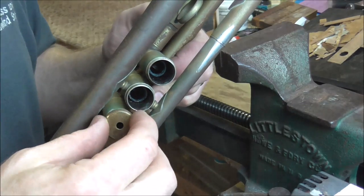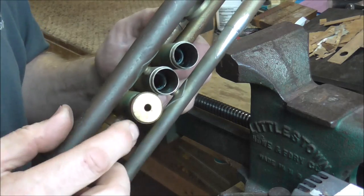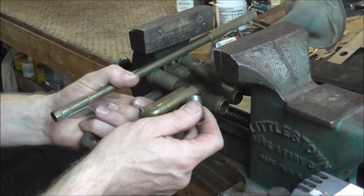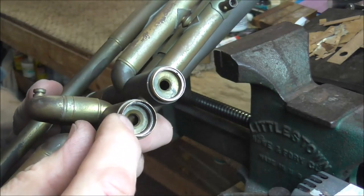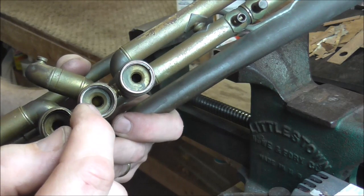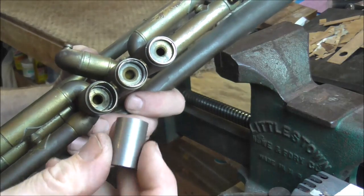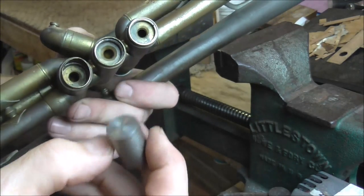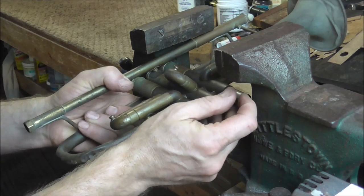I have a valve cap I'm going to use to protect the threads on the top of the casing. It is not the one that goes with this trumpet — it's one I just found that fits. It's actually a bottom valve cap being used on the top, but I'm just using it for protection. I'm going to put this in the vise. This cylindrical piece of metal I made on the lathe fits in there fairly tightly. There's a little cap that goes on the bottom of the valve — if I pushed something inside that cap, I'd be pushing so hard it would push that cap loose, become unsoldered, and damage the ports inside the valve. So this piece of metal will push on the outside of the valve to keep the inside from getting pushed in.